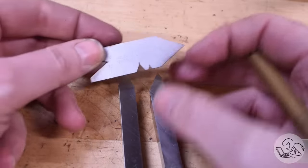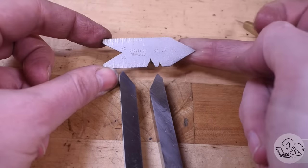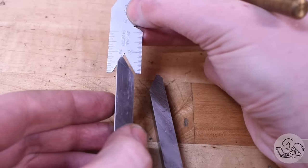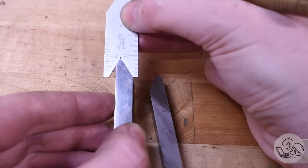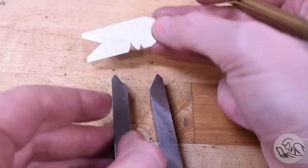And then you'll need one of these. This is commonly called a fishtail gauge. It's got cutouts in it that tell you the exact angle to which to grind your tools. You can use it as a template for grinding your own threading tool, and it's also used to align the threading tool later. There's one of these included in the back of the engineer's black book — there's a link to that below as well.